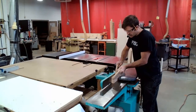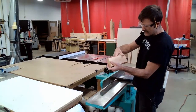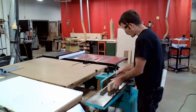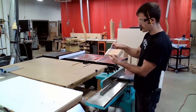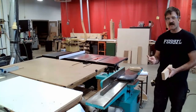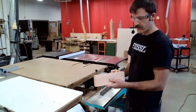Pressure into the fence with my left hand and down onto the table with my right, transferring some downward pressure to the outfeed. Now I've got a nice sharp corner with no wobble, and when I set my square on, I can see that those are 90 degrees to each other. So step two — jointing the best face. Step three — jointing the best edge. I'm going to mark those.